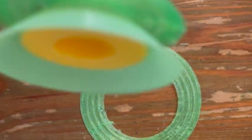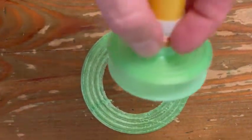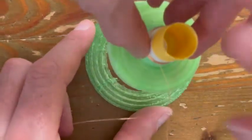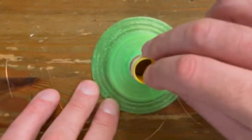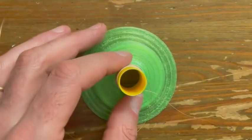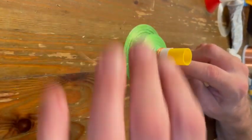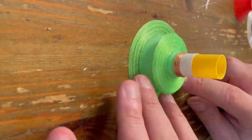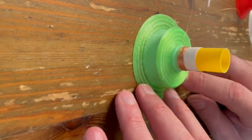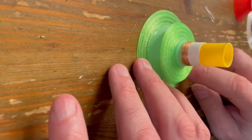And then you're gonna put the edge of the cone, the edge over here, inside the first sort of line, the first indent, groove. We call this a groove, inside the first groove. So you have to kind of press on it so that it enters the first groove. But press lightly, because the cone is fragile and you don't want to break the cone.